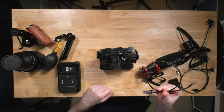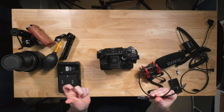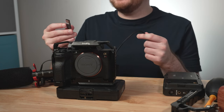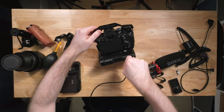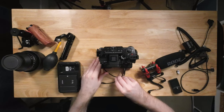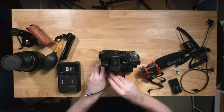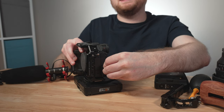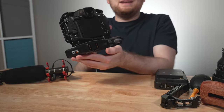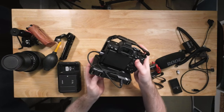We're going to use a USB Type-A to USB Type-C cable to connect the battery to the camera. I really like the 18-inch length because it provides a little extra room to wrap the cable tightly around the cage and body without having a piece dangling off the side. These are fairly cheap on Amazon — around $10 to $15. I'm using a Ugreen model here, plugging into the USB Type-A port on the battery, routing it under the body, and connecting it to the USB Type-C port on the camera.